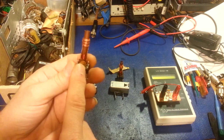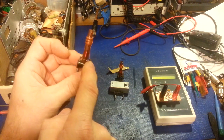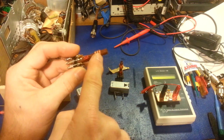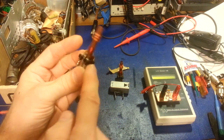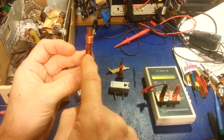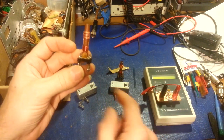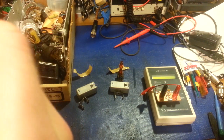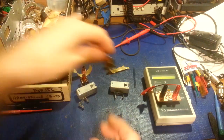This one here is in series with the receive coil. The one lead goes down to the common center terminal, goes up to the coil, comes down from that coil, goes to the silver mica cap, and then out. The transmit circuit ceramic capacitor is in parallel with that coil. Kind of hard to test it on the LC meter with the capacitor in circuit.